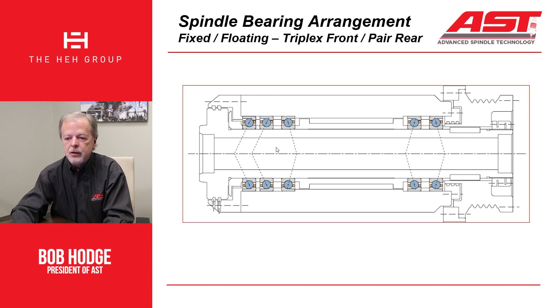There's a little spacer here, but there's not enough space to put in a quad set of bearings. So what we would do to improve the situation — since we can't put in a quad set — is put in two 15-degree contact angle bearings up front, and react that with a 25-degree contact angle bearing in the back to better balance the preloads of the entire system, so you don't have as much of a weak link built in.